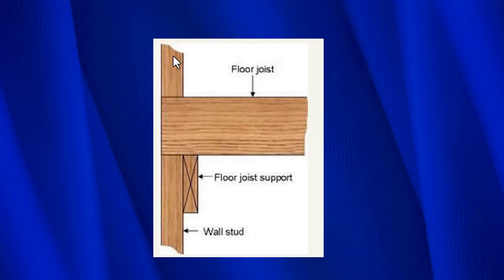This detail might help you understand what balloon framing is a little bit better. With balloon-framed houses, they would build the walls first — and those walls might be as much as 16 feet tall in San Francisco, because they had really good, tall, straight wood. They'd build the wall and then attach the floor to it. To do this, they used a ledger nailed to all the studs so that when they put the joists on, it would be level. First they'd level the ledger, then put all the joists on top of it.